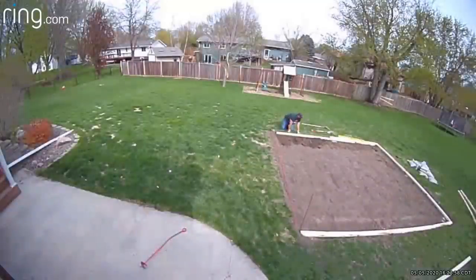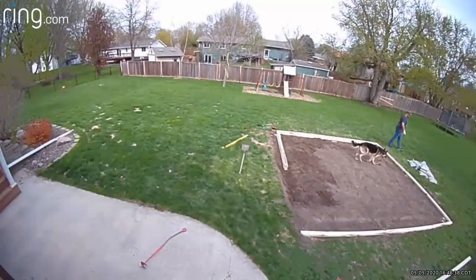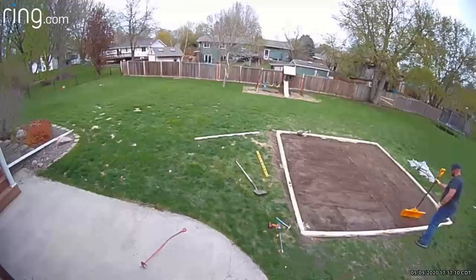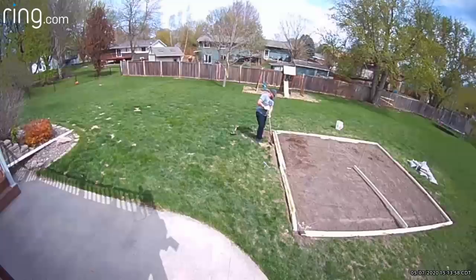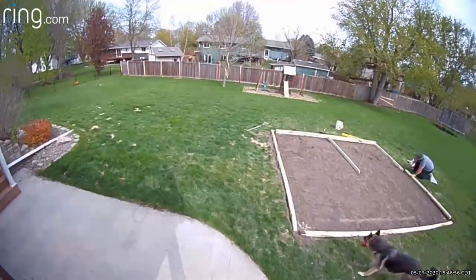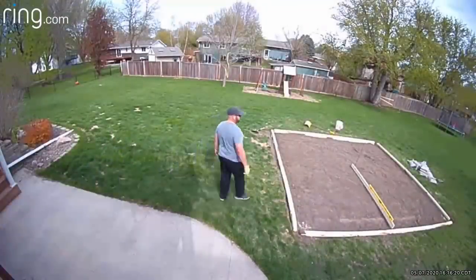That's where one of the big mistakes came in. When I laid down those landscape timbers, I put them inside the 15 by 15 square we had measured out, completely forgetting that the timbers themselves would take up space. My square was now closer to 14 by 14. So you can see me here digging up more space and bumping out the landscape timbers a bit further. I drove each one into the ground using about eight-inch rebar — I put holes through each timber and smashed the rebar down into the soil.